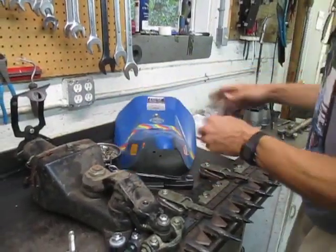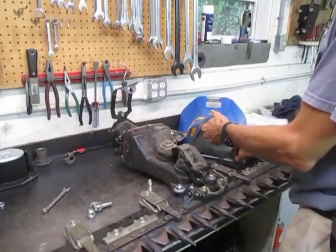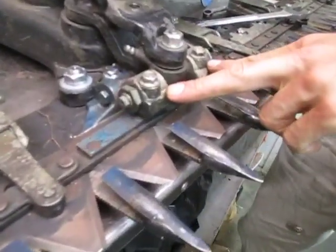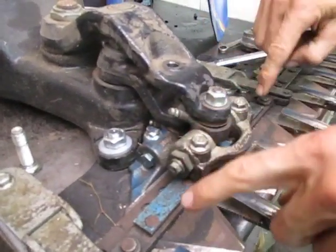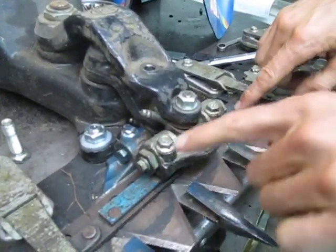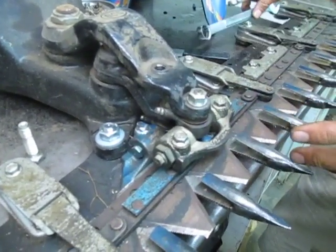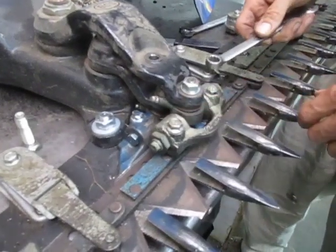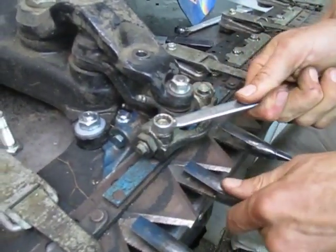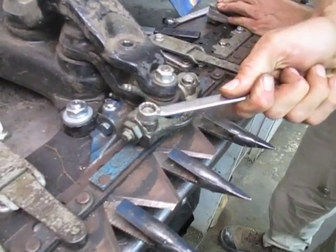I'm going to show you some of the high wear areas on these sickle bars. One is your blade coupling - this is what your drive arm fits into. The blade coupling is bolted to the top of the moving cutter blade, coupling the blade to the drive arm. As a result, this takes a lot of abuse - it goes back and forth six or seven hundred times a minute when you're using the machine. These bolts take a lot of stress, and if you're mowing for days on end you'd be well advised to put a wrench on these and make sure they're tight.